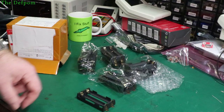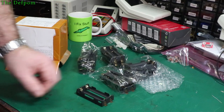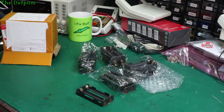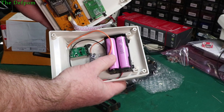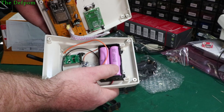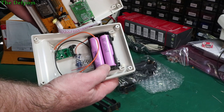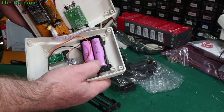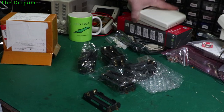The Chinese plastic factory didn't smell too good. Plastics do have a smell to them, but I can smell a burn - they're having a bit of a burn problem with one of their machines. So as I'll say, I've already got some other ones in these. I've actually lubricated these with some silicone grease to make them slide a bit better because they tend to bind up inside the connectors, inside the housings, and they don't actually push hard against the connectors at the end. The actual connections weren't domed enough, so the 18650 battery top wouldn't touch it because these are actually slightly recessed. So it just didn't work. I actually put solder blobs on them to make them fit, so I'm not particularly happy with that particular design.